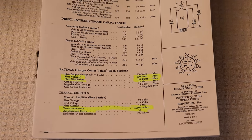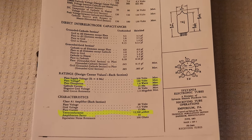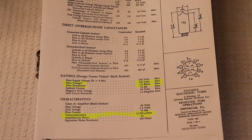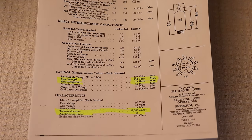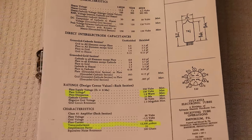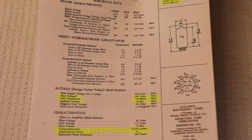It's in a useful area for a preamplifier. Most preamps don't need a gain of 33, but a lot of designers like to have room, and this gives you that room. It allows you to use the tube in circuits that need a little bit more gain if you're running it in two stages.